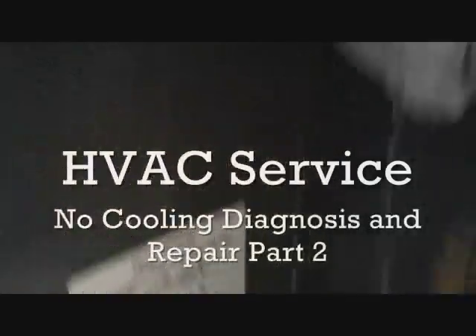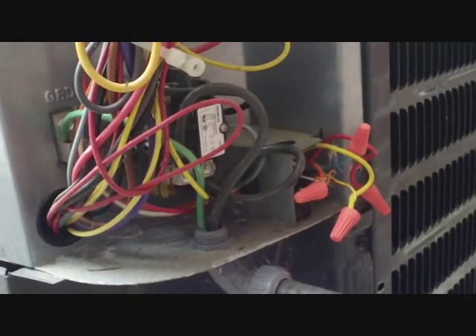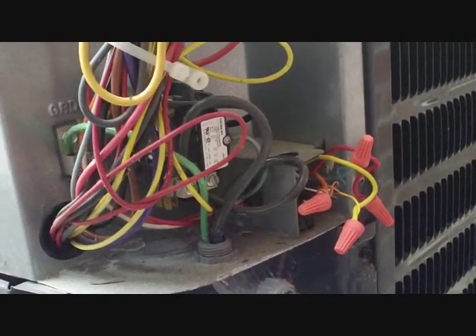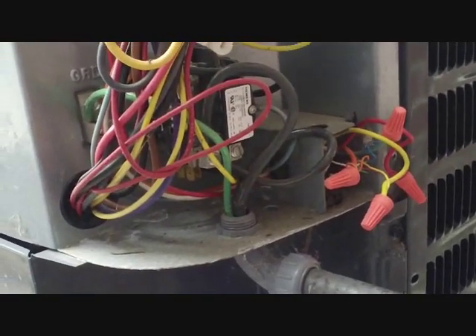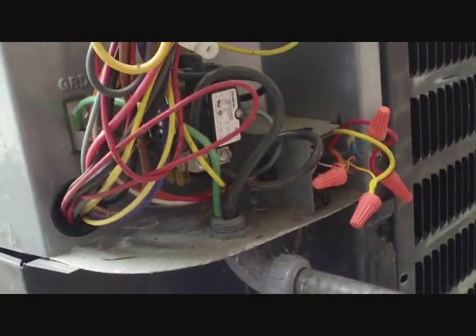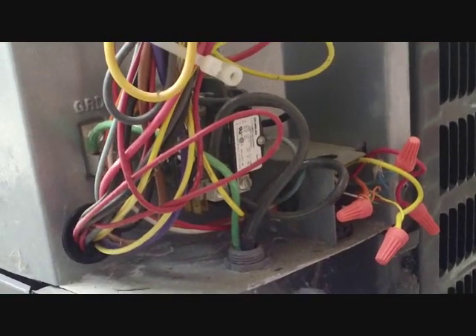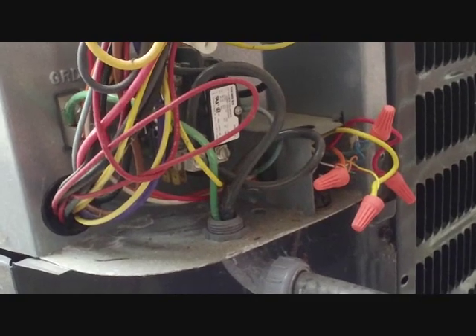We're back here to change out the TXV. It's been a couple days — I had to order the TXV. The homeowners went on vacation, but I told them I could control the system functions from the air handler to check it out and charge it. It may be a little cold to charge on sub-cooling today. A cold front came through North Carolina and it's now about 10 degrees colder than it was at lunchtime — probably in the mid to low 60s. You typically need it around 65 to get a proper sub-cooling reading off the TXV.